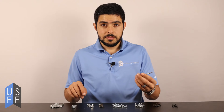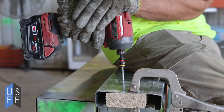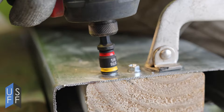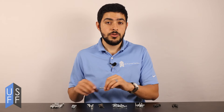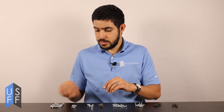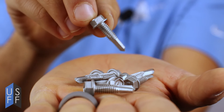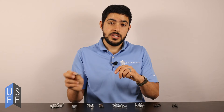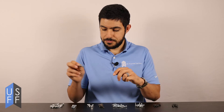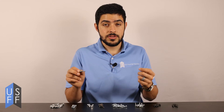The last few screws we're going to talk about are some specialty screws. We have very long hex heads that are helpful if you need to connect wood or other thicker substances to a metal stud. We also have specialized screws for drilling through structural steel. This structural steel screw can drill through at least quarter-inch steel, and you can use it to connect a metal stud to structural steel like a tube or an angle. A lot of people don't realize there are specific screws for these scenarios.